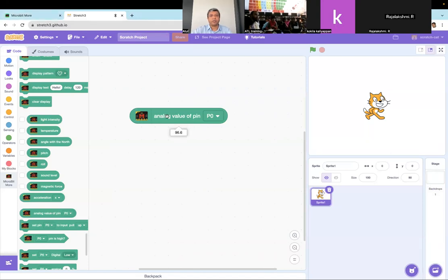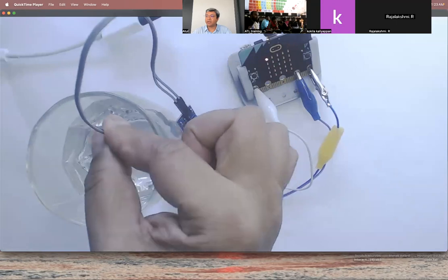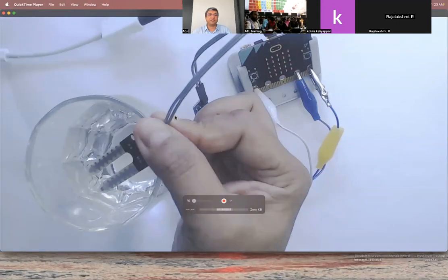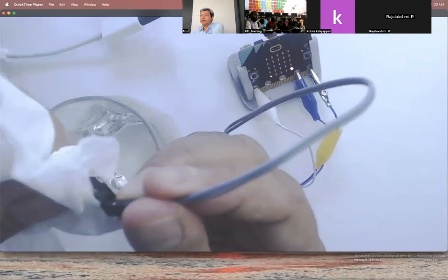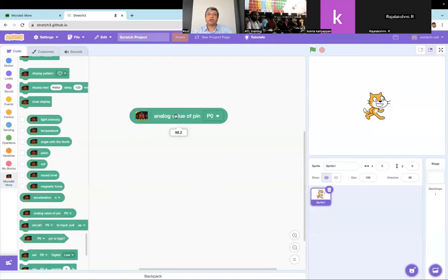So the value is 96.6 when my sensor is not in water. Now I'm going to put my sensor inside the water and see the value — the value has come to 35. It doesn't matter which analog sensor you are using, the logic will be the same: you need these two basic readings. Once when the sensor is in water my reading is approximately around 35 — let's say less than 35. When I take it out and dry it up a little, the value is almost 98 to 99.